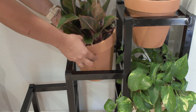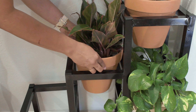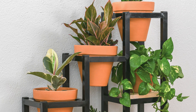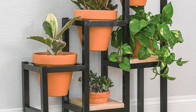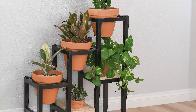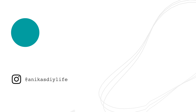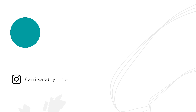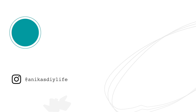And finally, it started to come together and look like the plant stand I had envisioned. There can be a few drips of the brazing material which can actually be pretty sharp, so I went around and filed them down and cleaned them up the best I could with a metal file. I cleaned it up with acetone again and gave it a few coats of glossy black spray paint. Then I added tube stoppers to all the legs and the open ends on the top. I added a few pieces of 1 by 8 boards to the bottom levels of the stand to keep smaller plant pots, and added 8 inch pots to the top.